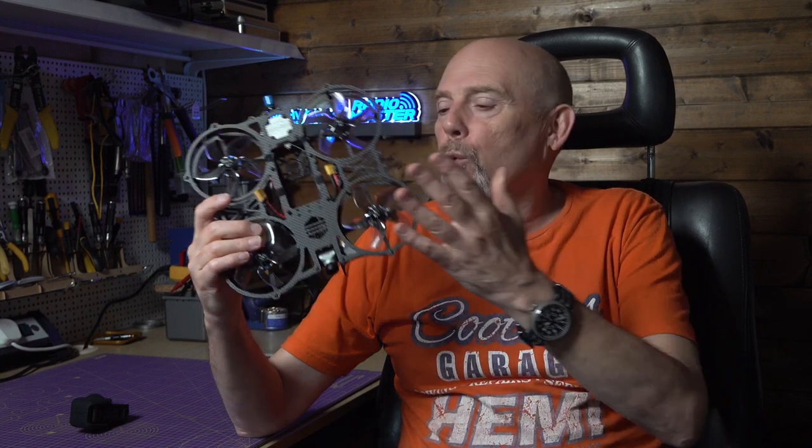Now, I just couldn't be bothered to take this all apart yet again and do another flight test, so I just swapped the flight controller board for a spare one that I've got. And now this flies just as it should. Hopefully, even though I got a bit thrown off track, this shows a logical approach to solving the yaw twitch problem. Yes, I could have just checked the black box logs after I checked the stack mount and capacitor, and I'd have solved it faster. It just goes to show you never stop learning in this game, and something different can throw you off the scent. But that's half the fun of FPV: building, flying, fixing, learning. It's fantastic.